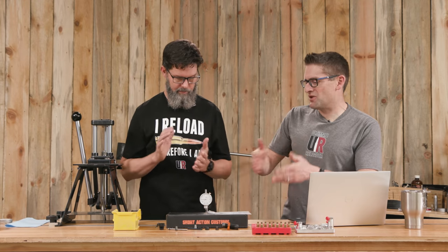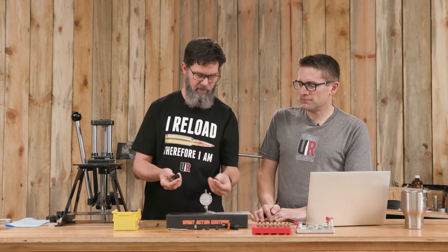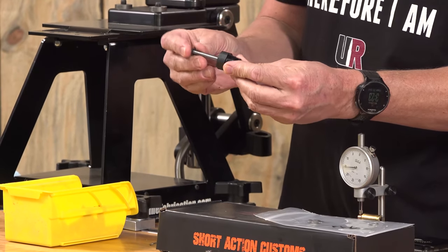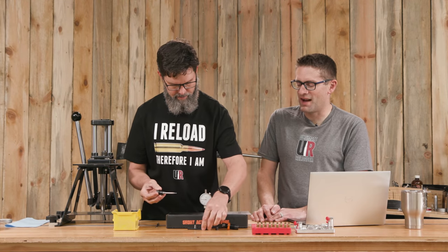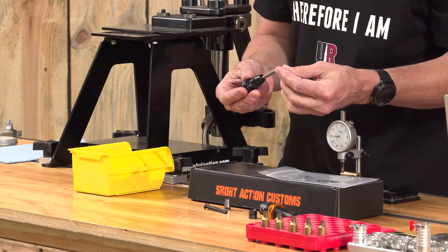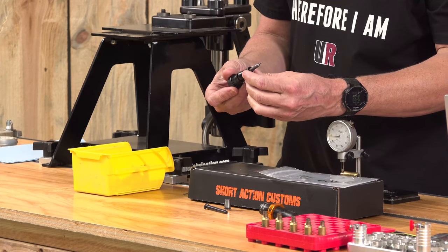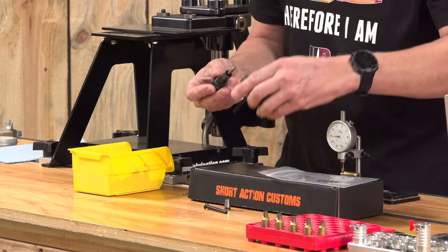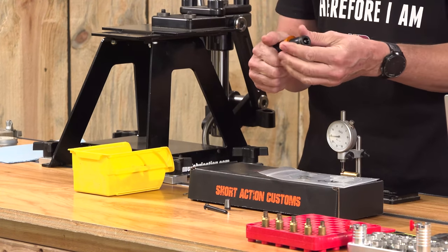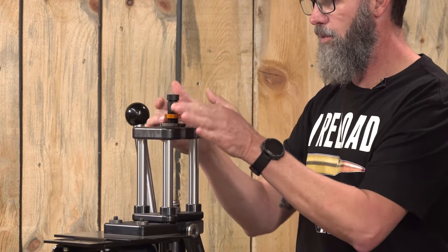Here are the parts. We're going to put the decapping pin on, so you have to put the collet in first. You know these guys are machinists when they've got ER collets that snap in. Then the taper adapter, one shim — the magic number of shims, got to remember that — and the 266 neck bushing. That's it. Voila. Then we slide this into our Prazi press.